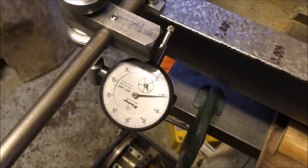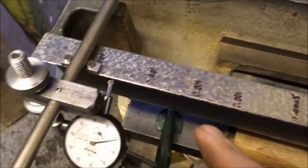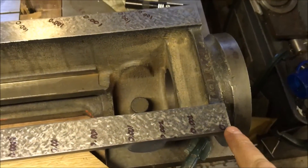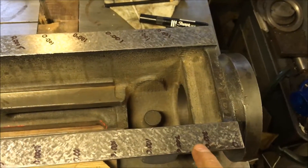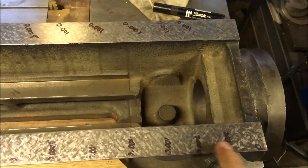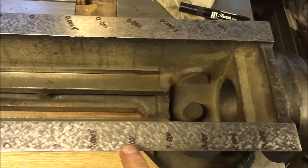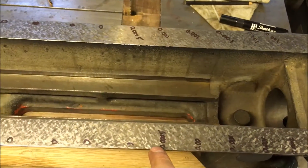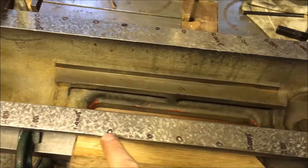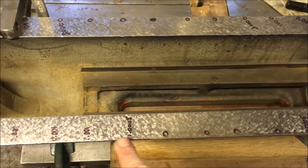So where we're at: running down, taking measurements and mapping it out. If I zero it off at the front corner, I've got a jump of 2 thou, then down to a thou — just re-checking all this area here — then I've got a thou readings continuing, and then back to zero in the mid section, and up half a thou.